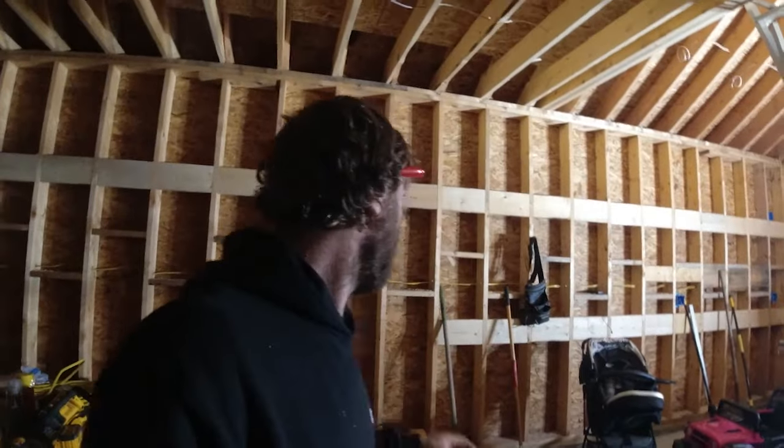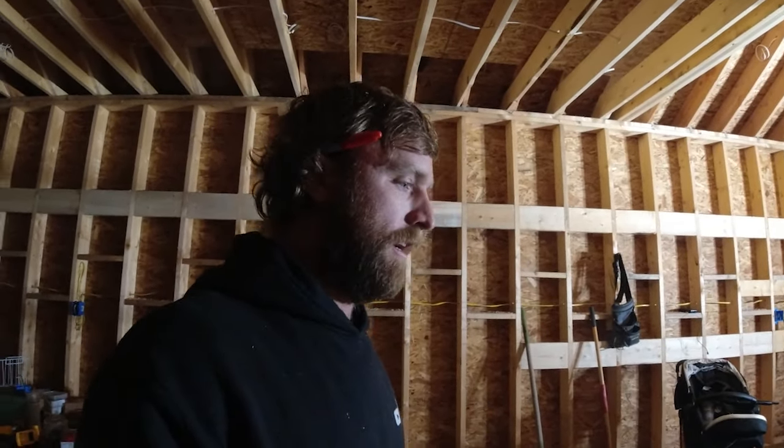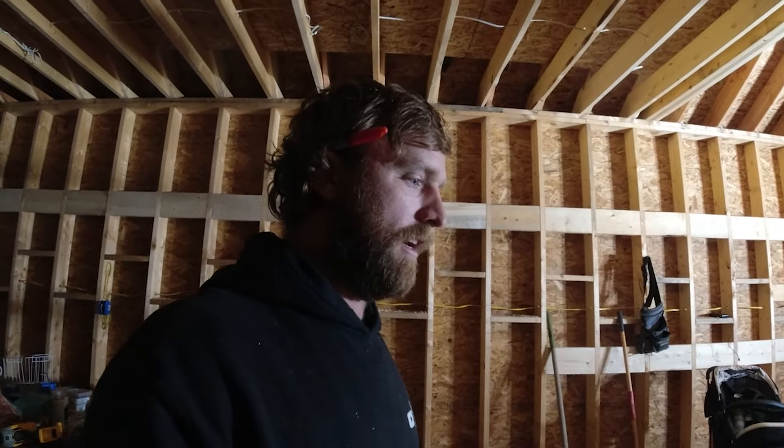So one more home run with a couple stops left to do, and then I need to go around and put in pigtails in all of the outlet boxes. But frankly, it's getting dark and I'm just really not in the mood to be working.